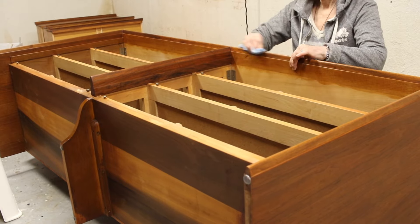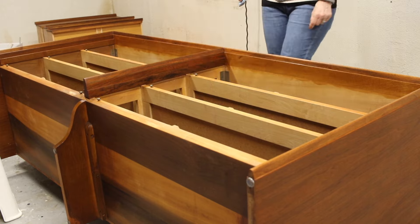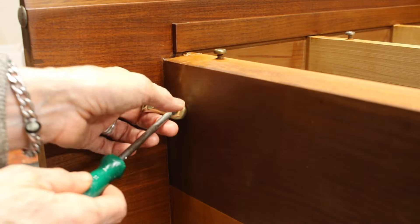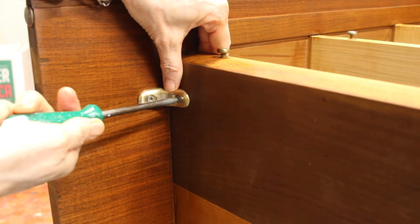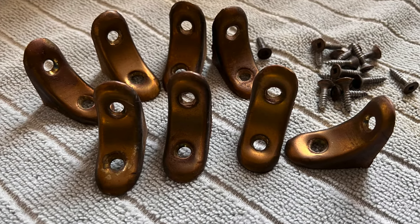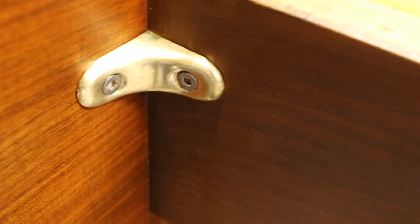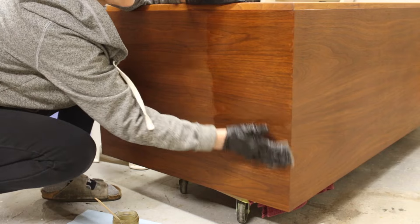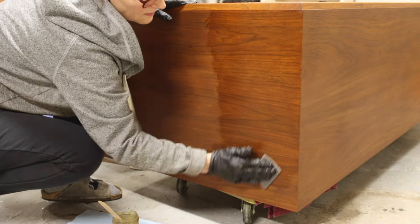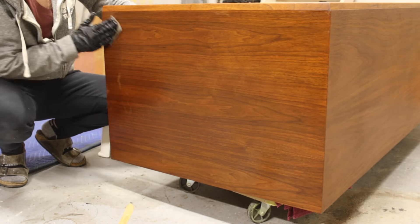I oiled the underside of the dresser as well — the wood was really dried out and it looked like it just needed some nursing, so I added oil there. These little brackets on the underside add a bit of stability to the sides but they're also very decorative. When I first got the piece they were nasty looking, but once I used a little bit of elbow grease and Barkeeper's Friend they shone up really nice. The last step was to oil the entire outside of the dresser — sides, top, front, and even the back. The drawers have been done, and after it was oiled and completely buffed twice just to make sure there would be no streaks, it was ready for the reveal.